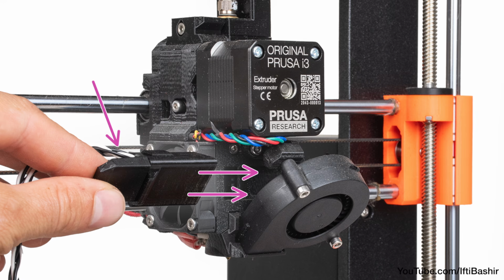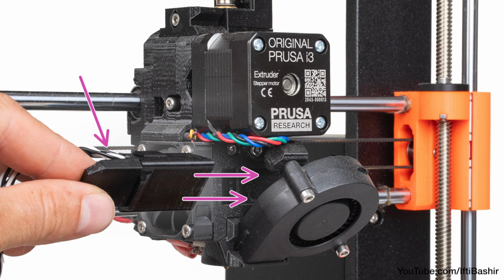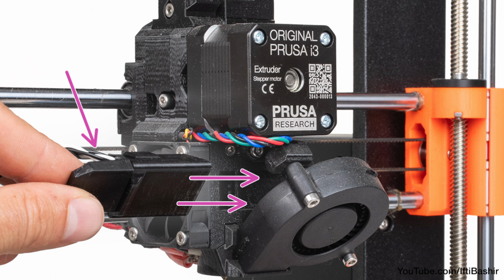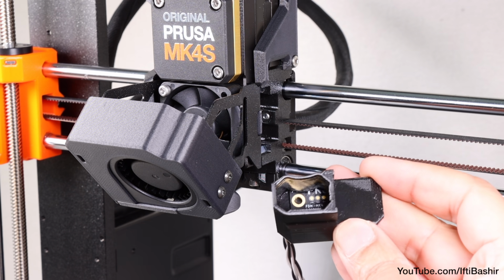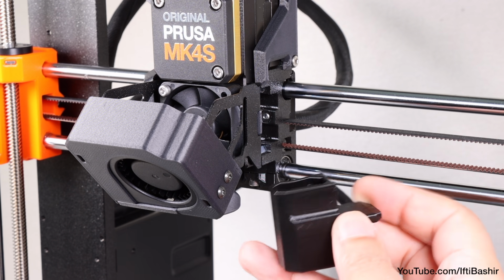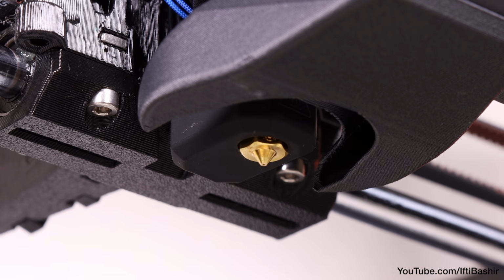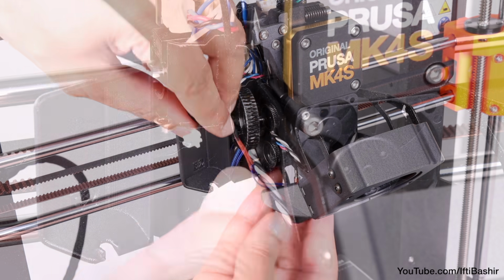If you are calibrating a Mark 3.5 or 3.5S with the triangular shaped bracket, you'll want to insert it into the designated area just above the print fan. For anything newer, we'll be inserting the open end of the module onto the heater block. To do this, we need to remove any installed silicone sock. Easy for the Mark IV, not so easy with the fan shroud on the Mark 4S. Although you may find it easier to actually remove the nozzle in order to easily remove the sock.